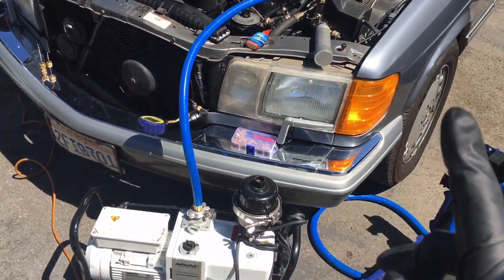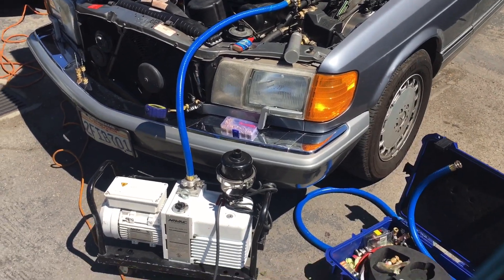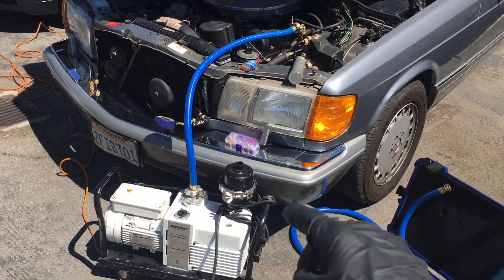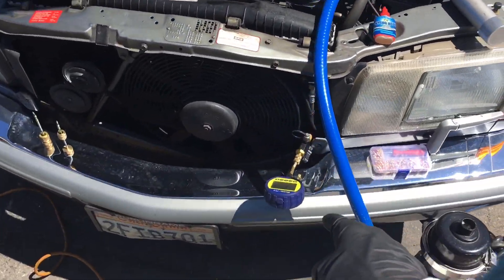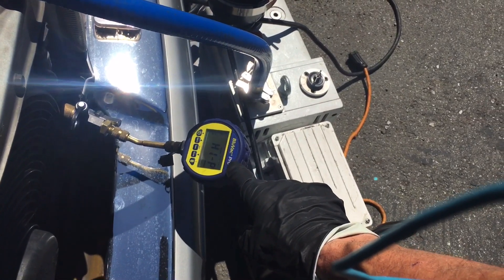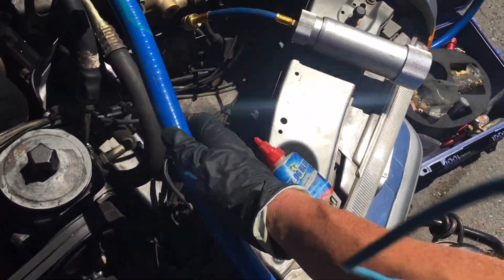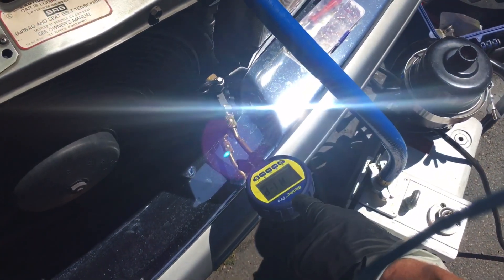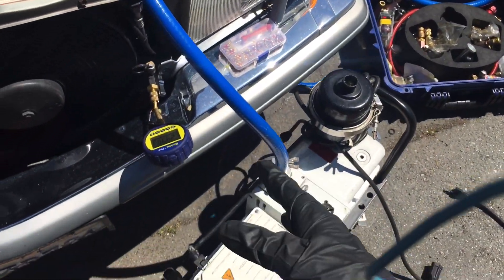What I'm going to show you today — and I'm not showing the full procedure, but I'm going to start weaning in, maybe every month, a little bit more about a one-hose setup or a two-hose setup and using a micron gauge. The micron gauge here on my Blue Vac — that's one type. I have one line, three-quarter inch silicone hose going into the low side line, and then over here on the high side I just have the micron gauge because I want to read what's on that side.